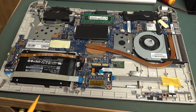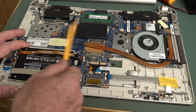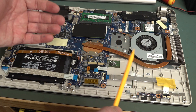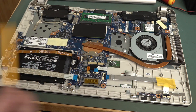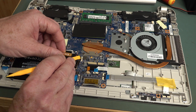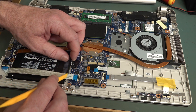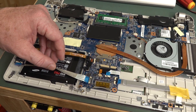The bare board and assembly cost is going to cost more if you have this big cutout for the hard drive — you'd waste a lot more panel area. When you've got two motherboards per panel, when it's going through the pick-and-place machine, it's already picked up the part so it can just place it here and place it here — you run effectively two boards. Anyway, there's the cable — I didn't see that. Oh, okay. So anyway, that's actually a Samsung. Wow, I can reuse that.